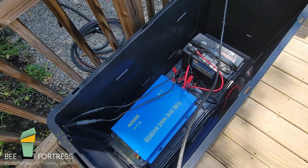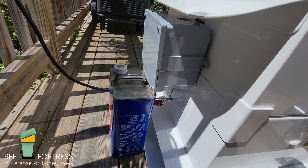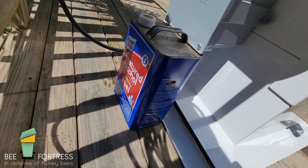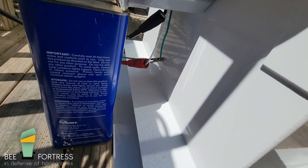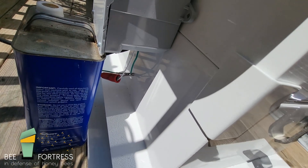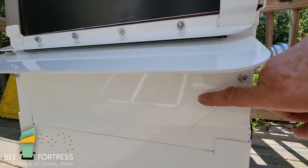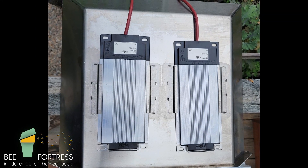So why would I want to power a beehive in the first place? I've got a temporary control box — I've got a new one in the queue to be produced. I put it on there with Velcro, but it's not holding, so I've got it propped up with this empty can. We wouldn't want to be putting flammable fuel next to some alligator clips in case they arced together — that'd be stupid. I've got these alligator clips: there are three — one for line, one for neutral, and one for ground. Plate heaters connect underneath the pan and make surface-to-surface contact. This is 100 watts, not much.